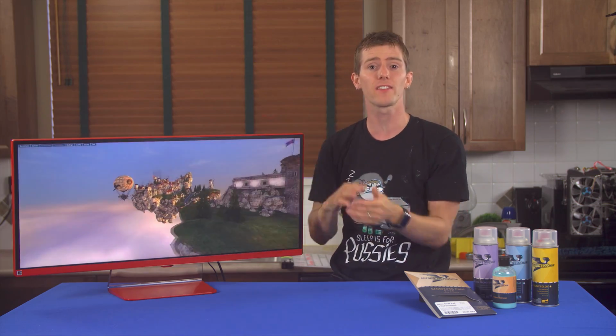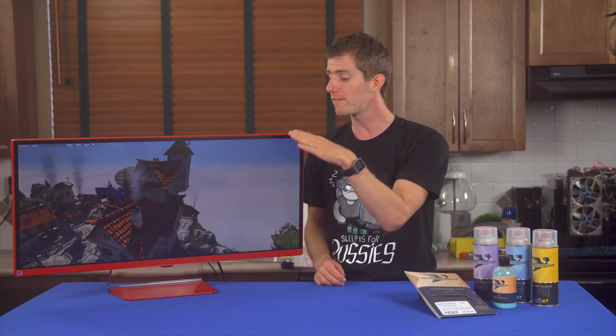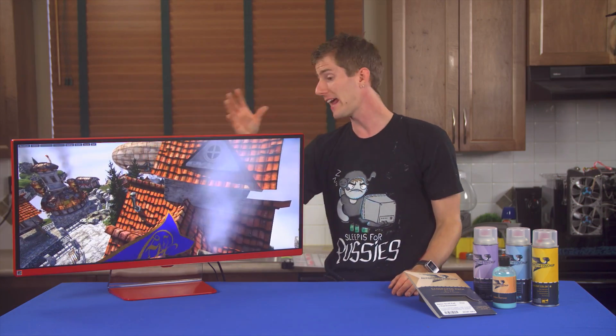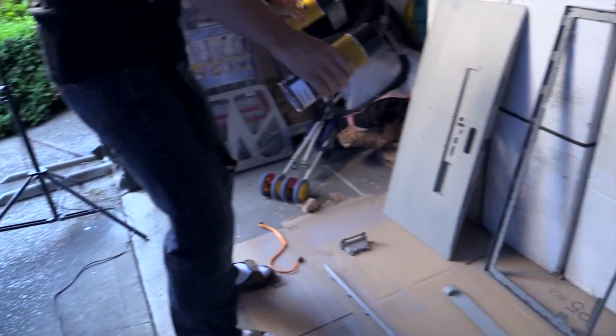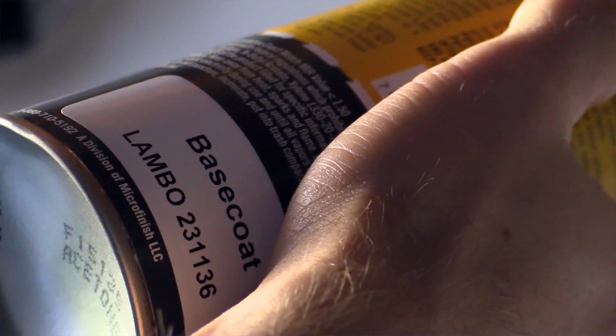Wait until the coat you're working on dries and you can actually usually get little bits of dust out with the tack rag. And even if you can't, you're better off having one very small problem than several big ones, and I was surprised at how little of the junk that got stuck in it shows up once you're done with polishing.